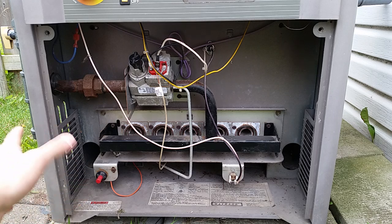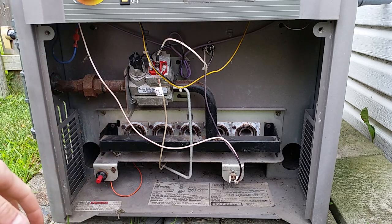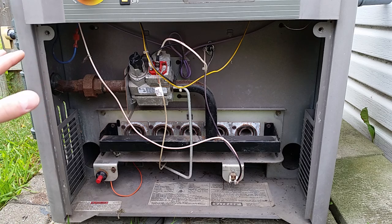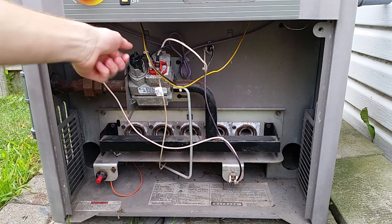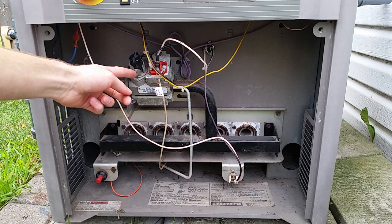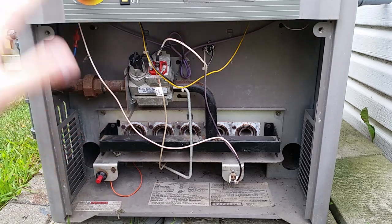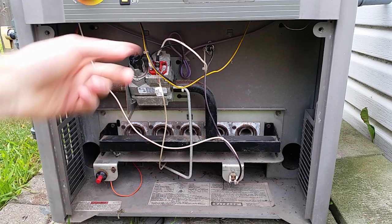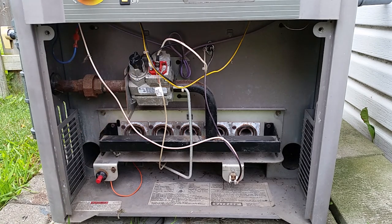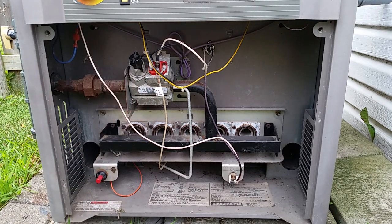My light lit in one shot - and this thing's about 10 to 12 years old and it just fires up every single time. It was actually sitting dead for about 10 years of complete non-use, and I only fired it up this year. So you turn your knob to pilot, you line it up with the little notch, hold it down, and push your igniter. You're going to want to hold it down for a good 30 seconds to a minute just to let that gas come through and start generating some current. Once your pilot light is lit, you want to make sure it's actually generating power.